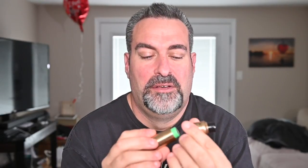The threads on the mechanical tube mod are short but flawless — very smooth with no scratchiness. The button: I did have to change the spring. I took 18-gauge wire, made my own spring, and put it in to make the throw a little tighter, because the original was a bit loose and I'd built a little too low. The conductive spring shrunk on me. You take a screwdriver, wrap some 18- or 20-gauge wire around it, put it in and it works fine. I would have liked to have seen a solid silver spring in there since it's a conductive spring.